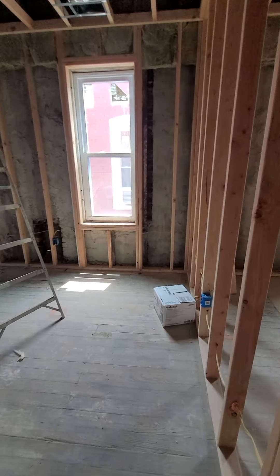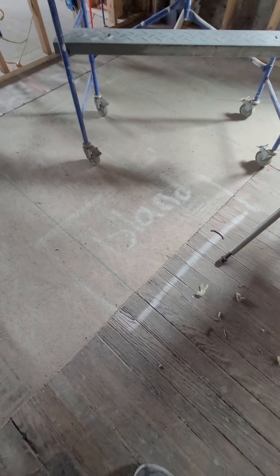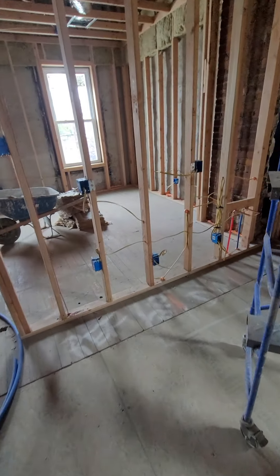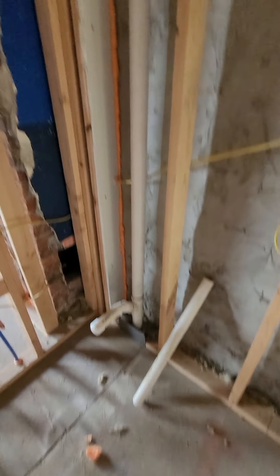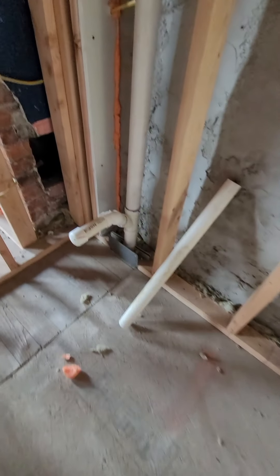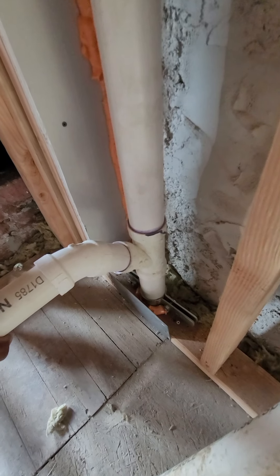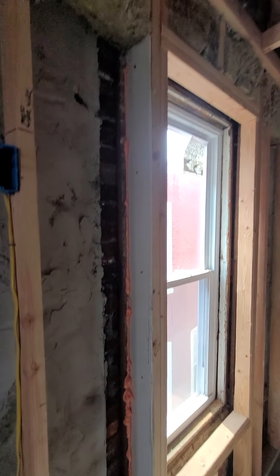Coming here, this is going to be our living room. Kitchen area over here — you see on the ground we can put an island right here. We're dropping two pendant lights there. We had the back vent because the kitchen is up front, so that's our back vent going through the roof. We got our protector plate there. We keep these loose until after we sheetrock, in case we got to take it off — we'll glue that in on the final. Got our fire stops again here.